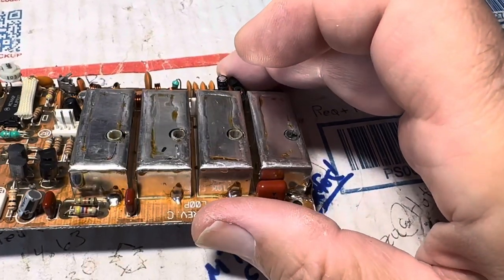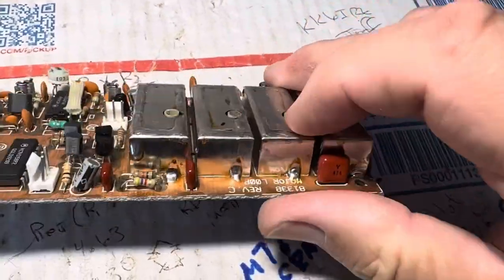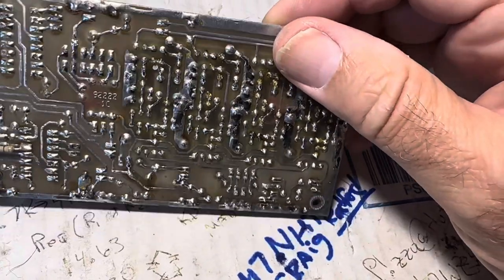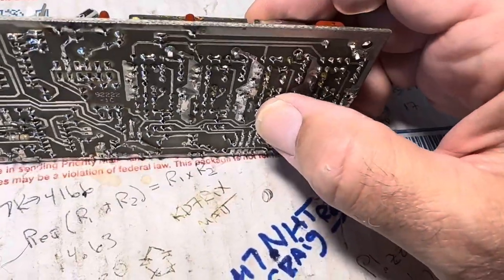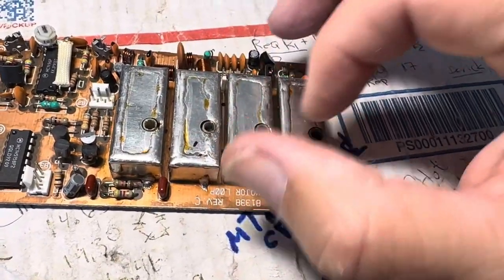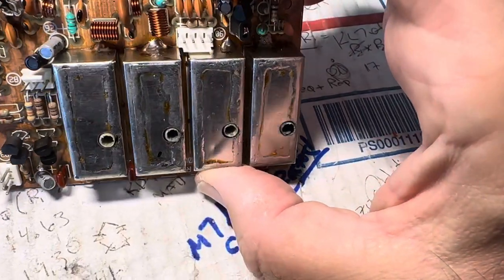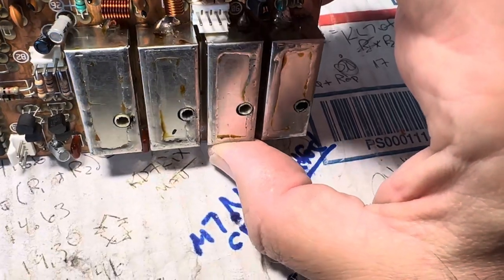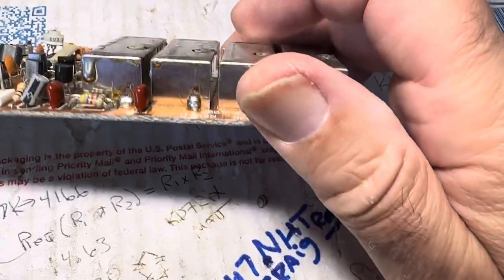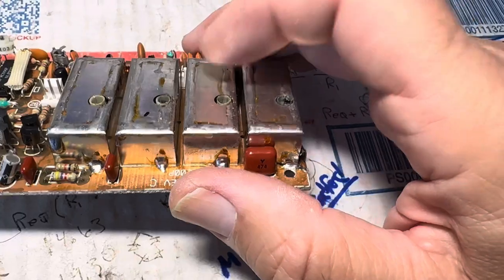If I could run this board in situ — meaning run it upside down — I could probably just add inductance to the coil. I have a whole box of inductances, and I could probably parallel those and get these things into resonance or into lock. That might be a way to do it without touching the slugs. I've got a whole bunch of coils of various inductances, so you can most likely parallel those with these and dial it up, not dial it back.